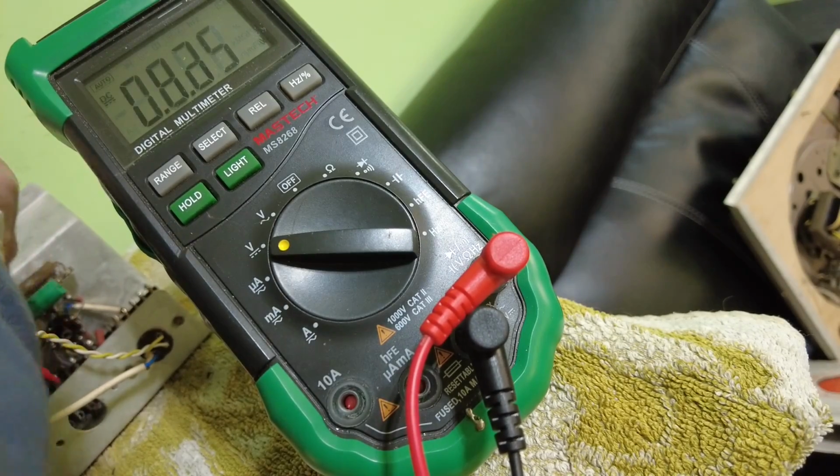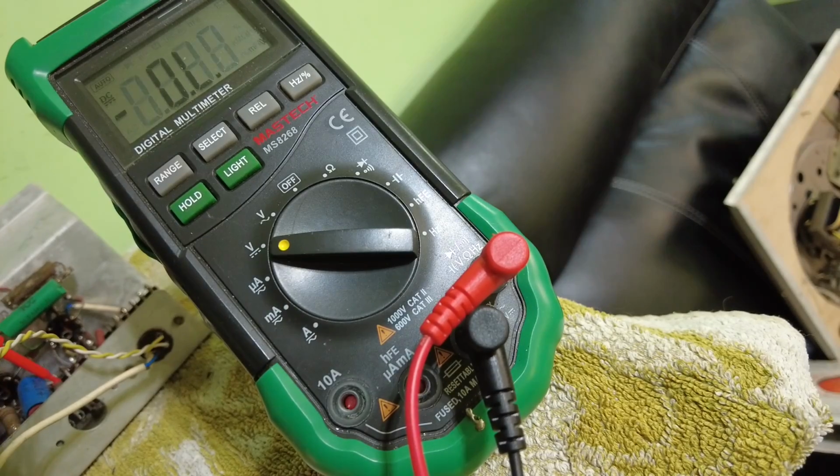And now if we go on to the other side of the output transformer, because that's where it's connected to the plate to cathode, remember, for these. So if we times that by 173, we get 9.62, and again allowing 5% for the screen. So that side's spot on, but the other side isn't. So could it be that tube? Well, there's a problem if that's not the problem.